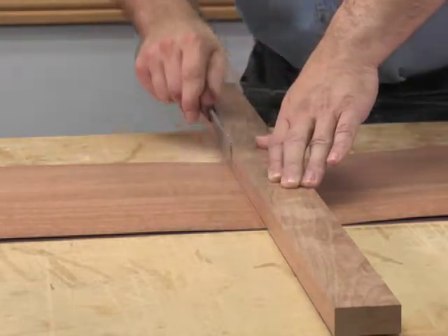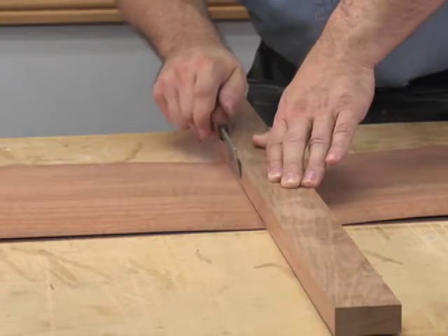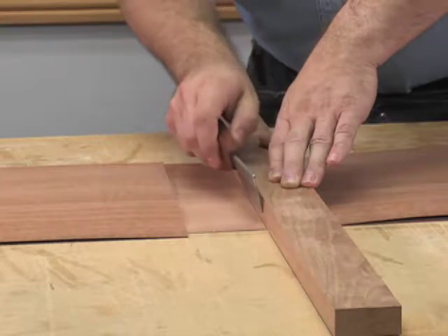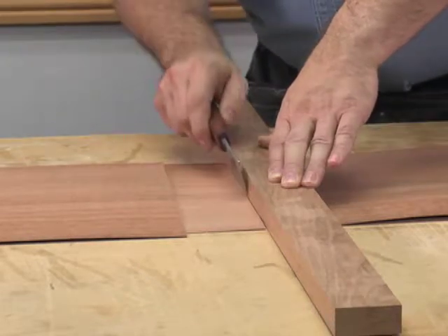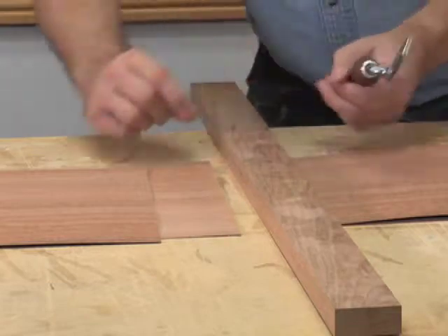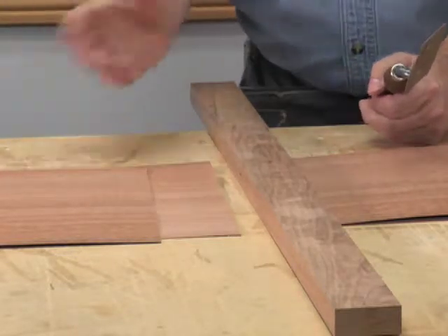You can cut through ten veneer sheets this way — not all at once, but one by one they're going to come loose. I've gone through the first layer there. And since everything's oversized, if I somehow made a mistake and came over here I've got room for error. That is cut through — I've cut right into that MDF. If the saw is too aggressive, sometimes especially at the end you might split the wood. If it's only split a few millimeters it may not matter, but if I split a whole piece off three inches long, maybe I needed that.